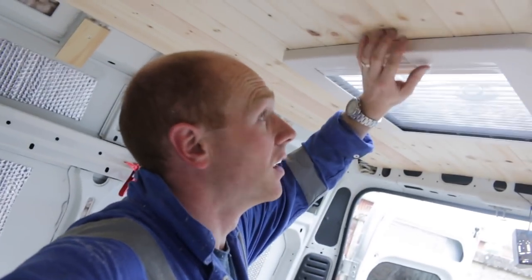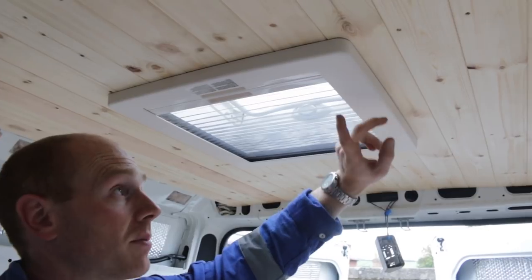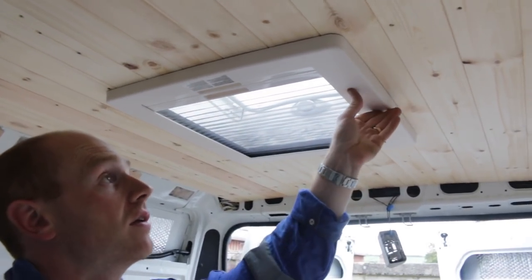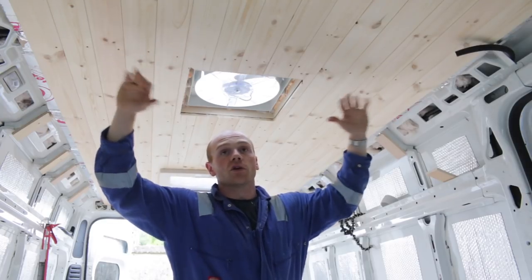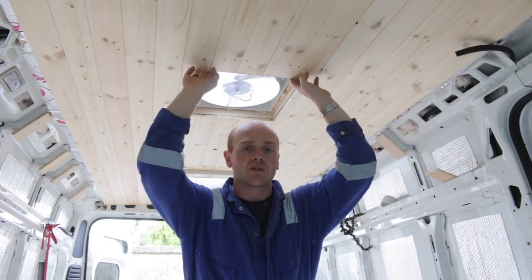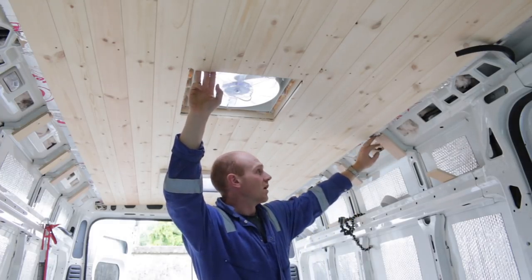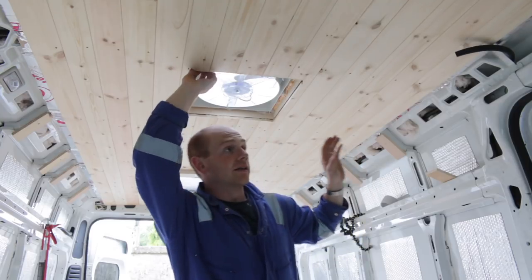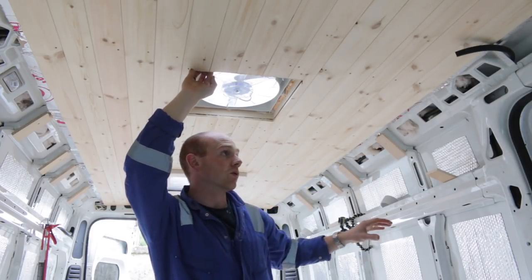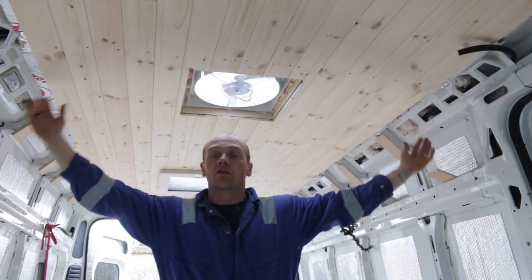One of the two is all finished. It's still going to get a paint, but it's fitting up nice and snug — I've just temporarily fixed it up there. This one has still got some clips to go in it which will hold it up tighter to the finished surface. So I'll cut the video there. You've seen how I've insulated the roof, the vapour barrier, and finishing out these openings. I'll use the same method for those angles — I've put these strips of ply on now, left a slight gap so they are completely against the rib, which means our angles are identical both sides. What I'd really like to do is run all of our wiring and cables through before I do any of these angled bits, because it's going to get tricky otherwise.